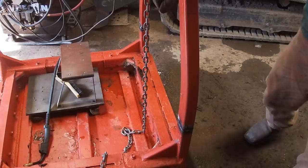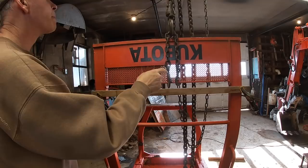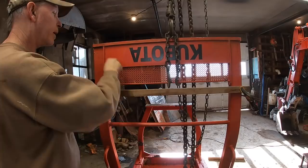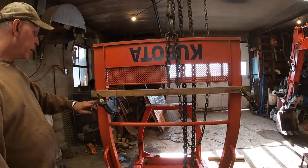Now we've got to cut off the front and lower that. Spun this around, hooked this up to the chain fall and took a little pressure on it so when I cut these it'll just come off. I leveled this. It's level here. It's level here. I've scratched these marks. Now I'm going to carry the marks around and do my four down and cut this vertical piece out at 4 inches.